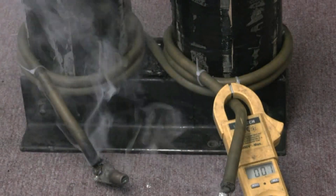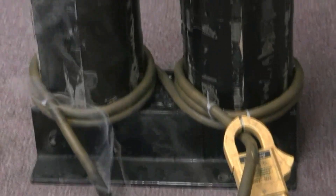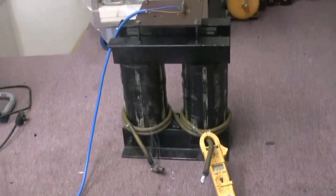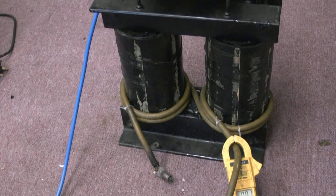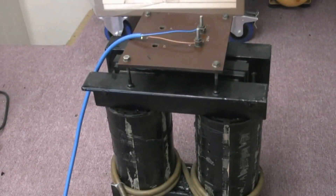That's 600 amps, just from that puny bit of wire — which is quite good. So I think we're going to have a bit of fun with that. Lots and lots of amps. That is going to be one monstrous transformer — that will kick out 10,000 amps or more, easily. We've got 24kVA there, and that's actually being driven on a Variac at the moment, which is OK to do under no load conditions.